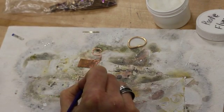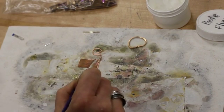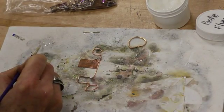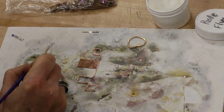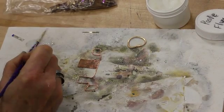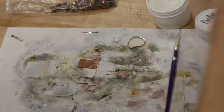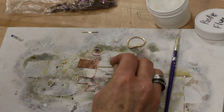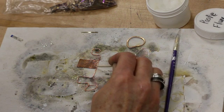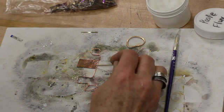You're going to lay the chips on right where the metals meet. You don't want the solder to bridge left to right — you want it to run parallel with the seam. The smaller the better, and you're going to place them about an eighth of an inch apart. If you have a larger chip, you can't control that as much as the smaller chips of solder, even though it might still work. Place four little chips right here — the flux will hold them in place once it dries.